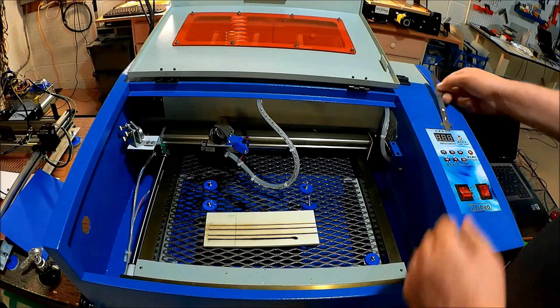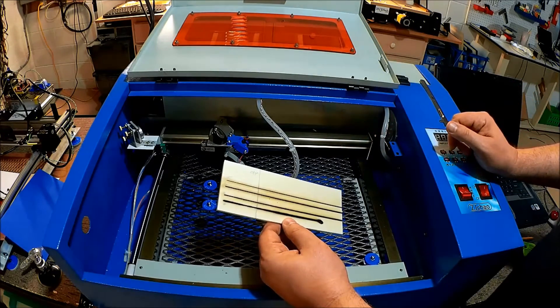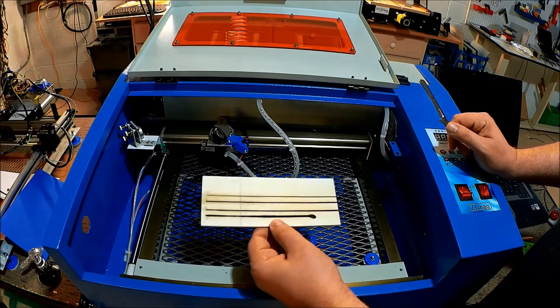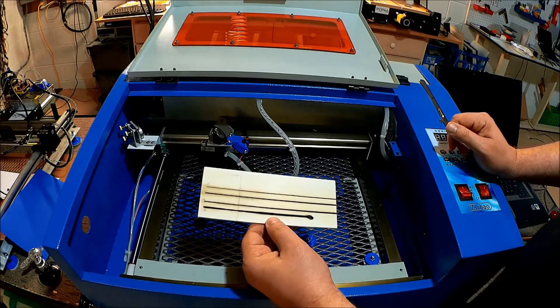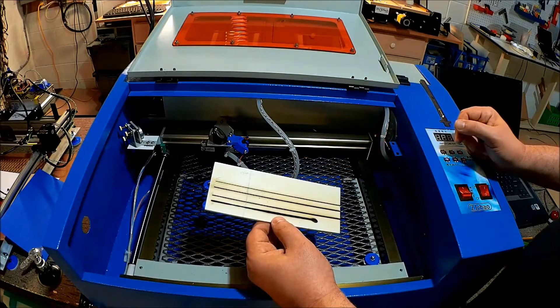The main point of doing this video is: if you get a new piece of material, it's worth doing the slant board method. Even if you know where your focus is at, it helps you clarify the focus for the board or material — whether it's acrylic or otherwise — and it also helps determine what your feed rate should be.